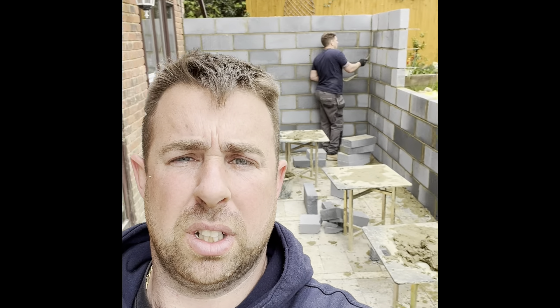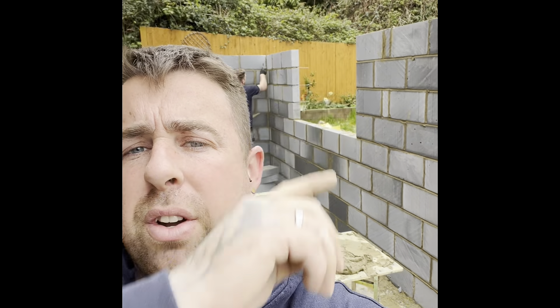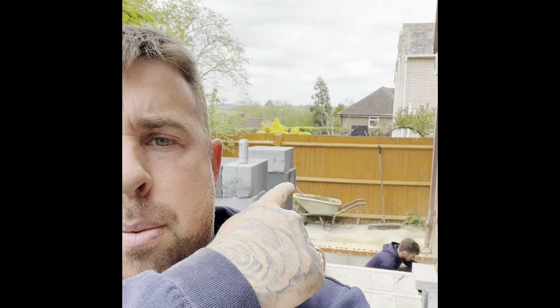About midday - I've fired in about half the blockwork. There's a 150mm cut on top of here for lintel height, solid wall with a set of doors going in here. The other end has got a window in the end wall, a window in the return, and we've got the reveal here for this set of doors.